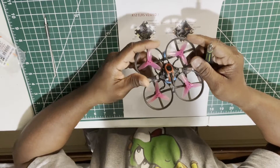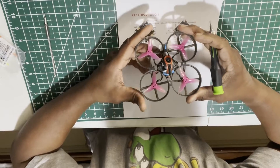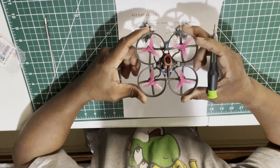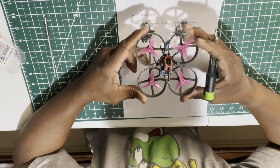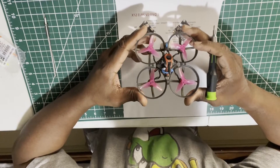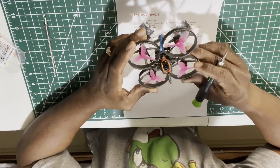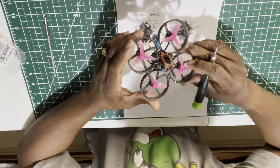The problem occurs when you're flying and you notice your link quality has been degraded. You get a failsafe and it just kind of falls out of the sky when you're flying it for a short distance. Most of the problems occur if you've got the ExpressLRS with the ceramic antenna.